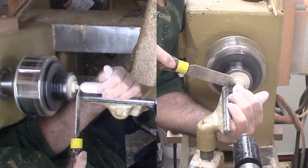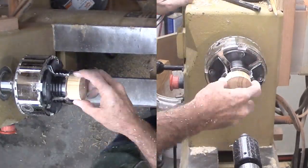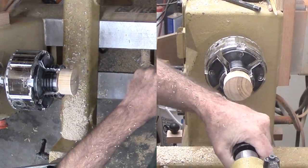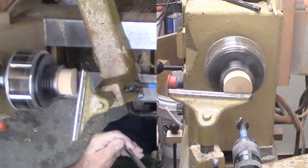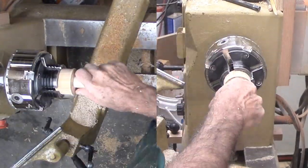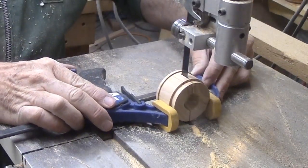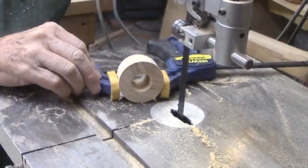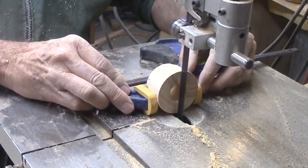This one is easy but I need to sand the other end. Previously, I prepared a short cylinder of cedar just a bit longer than the depth of my shark jaws. To make them useful, I need to drill a hole that is the same size as my cylinder. However, I don't have the correct bit so my hole is a bit undersized — I'll find out the impact of that shortly. But for now, I need to cut the collet from both ends at right angles to each other. I want to leave just a little wood at the ends so I have to cut with the round side down. A couple of clamps make me feel safer with my hands more out of the way.